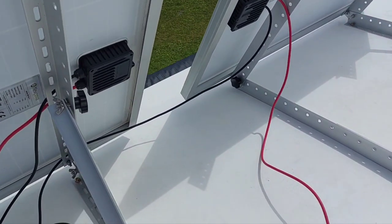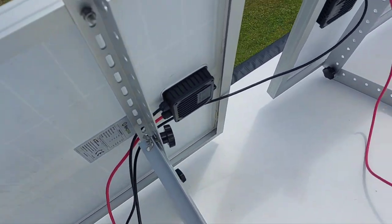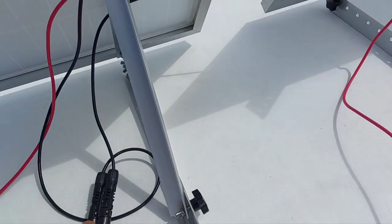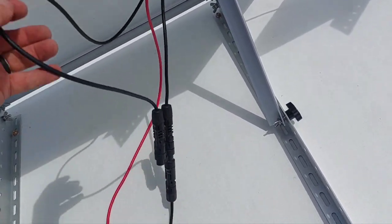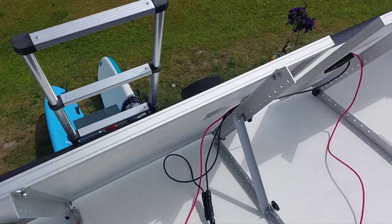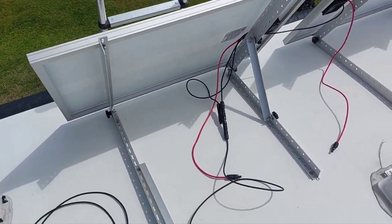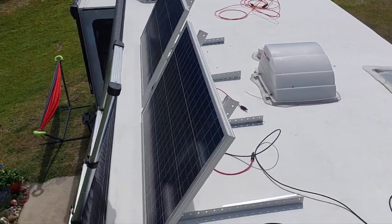Now I'm in my wires. I already had these — I've got a lot of extra because they used to be down on the ground, but I had to buy a splitter. I bring this black wire and hook it into this side of the splitter, and then this other one hooks to this side of the splitter. Then this one here goes to here, and I'll do the same with the red. Then I will tie up all the wires, fasten them to the deck — I'll probably put them out in here — use some zip ties to zip them down.